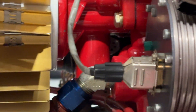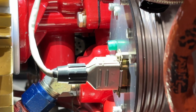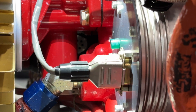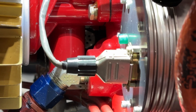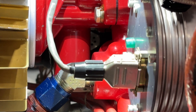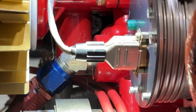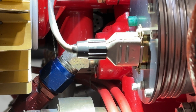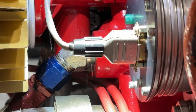Looking back inside, this unit has a hall effect pickup that goes into the magneto hole. There's a green LED back there — the way you time this system is to bring number one cylinder to top dead center and turn the pickup until that green LED comes on. We could not get that LED to light. We pulled off the DB9 connector and measured it — we did in fact have 5 volts at that connector. We cleaned up the contacts, put it all back together with Dow 4 to prevent future corrosion.